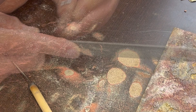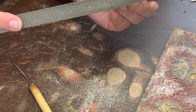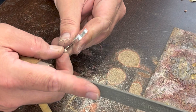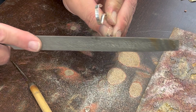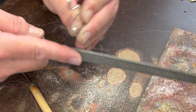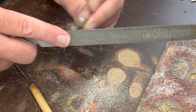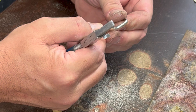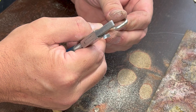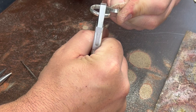I realized a while back that a lot of people think it's weird that I file right in front of me rather than pressed against a surface. Part of it is showing it to the camera, and part of it is just how I learned. One thing I do with the file is use it sort of sculpturally — because I'm not casting things, I don't have a lot of ways to change the shape other than cutting and sawing, so I like to file in some pretty intricate details. In order to get the two ends touching nicely, I'm going to have to bend the wire off to one side — push it past a little — so that when I pull them back beyond each other they'll be pressing together.